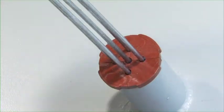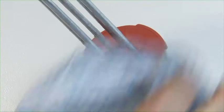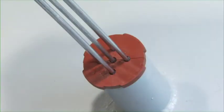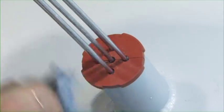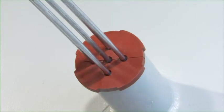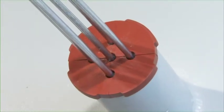The flanged edge of the sealing plug must be flush against the front side of the conduit. After installing the plug, remove any extra lubricant with a dry cloth. Make sure the compressed air is released from time to time by inserting a lubricated screwdriver between the plug segments.